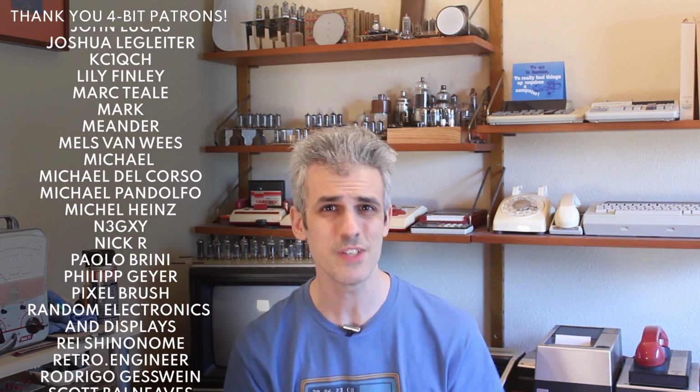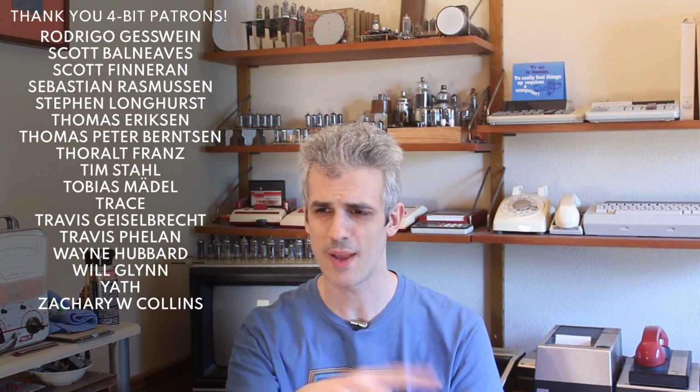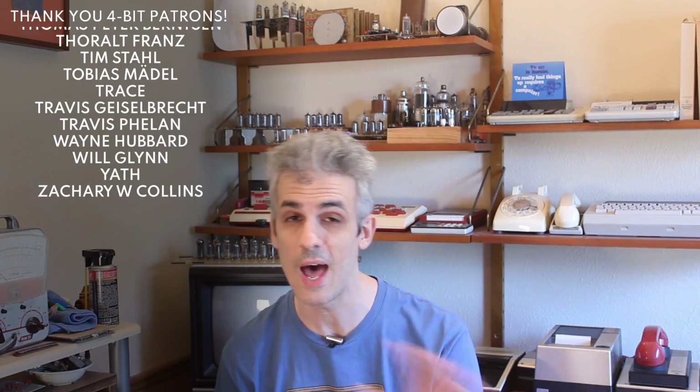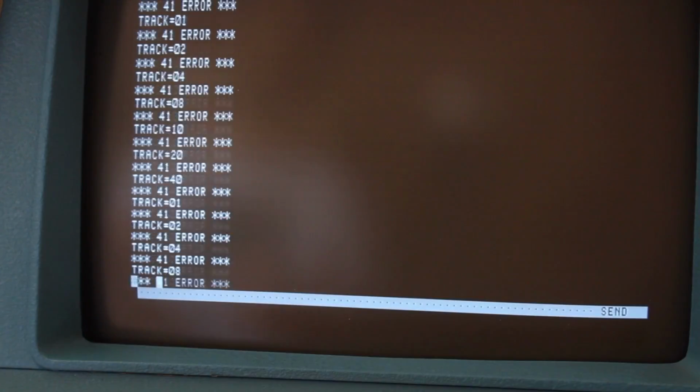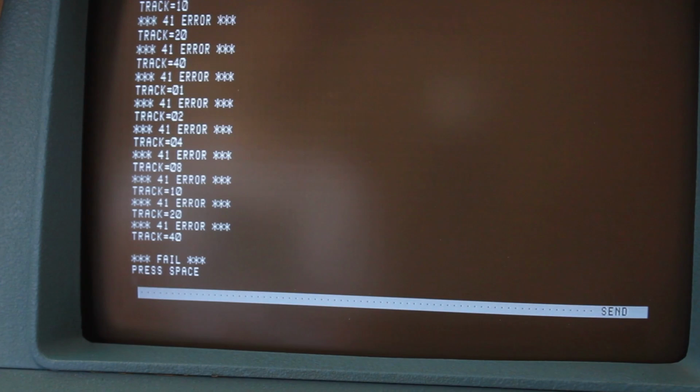First of all, in the previous episode, when I did the seek test that we found on the Hawk drive, I told it to go from track 00 to track 2F, and a lot of people commented that potentially the floppy doesn't have that many tracks. We've actually confirmed that the floppies have 4C tracks. So I didn't tell it to seek beyond the number of tracks that it had. I think maybe I just had a bad connection on the floppy cable there.